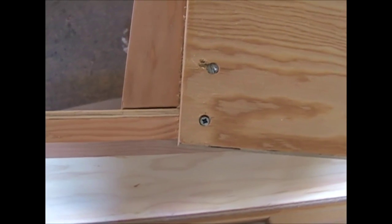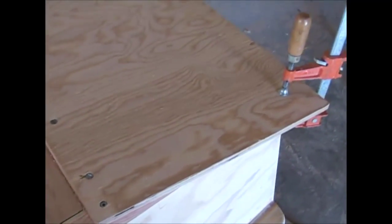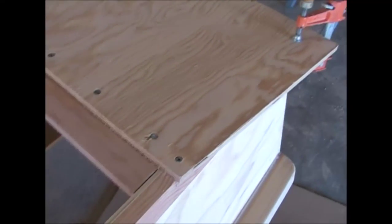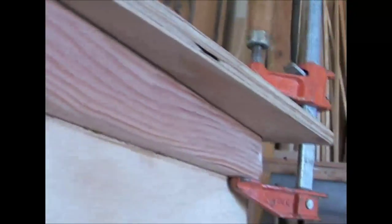1¼ number 8. It's actually a galvanized deck screw. I like to use galvanized on the bottoms. They're a little tougher coating than the plated. Still steel. I just like the steel screws because they're strong and affordable. So I've got it anchored with one screw on each side, and I've traced around the bottom on the outside and the back, and I've marked it wherever there's a fastening so that I don't hit the fastenings that are already in there.